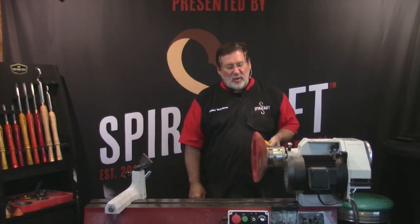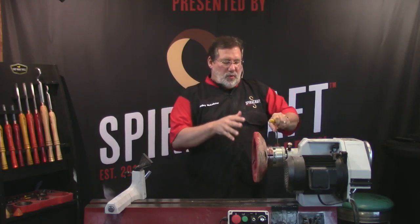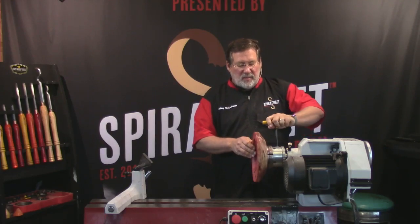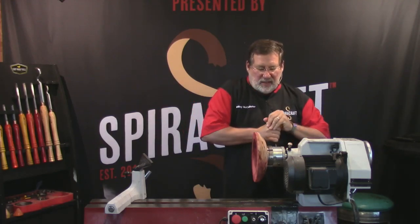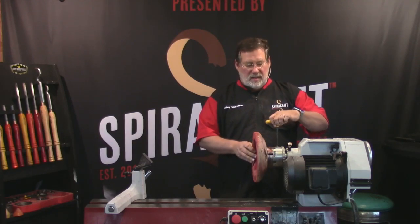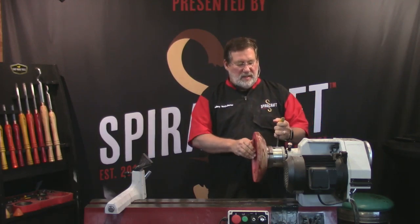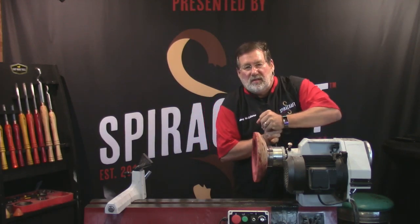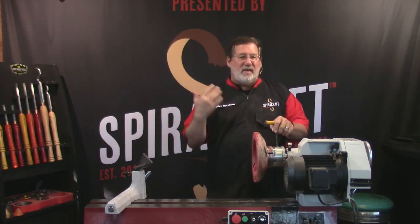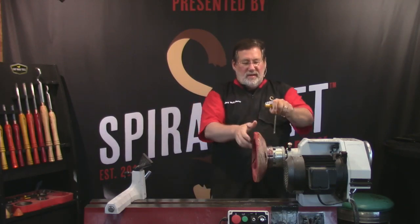Okay, so that didn't warp that much. So after the last time we were here, when we put this in the stabilizing chamber and pulled the vacuum on it, and we wrapped up, I did that on and off for a week. Over in the shop, I would go by, bleed off the air, switch the piece around, turn the vacuum back on, pull it back up to full vacuum, and I let it sit in there for a week, week and a half. I lost last week because we had no internet. That was a whole other deal. We won't even go there.